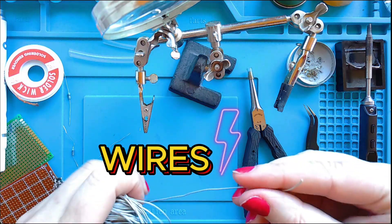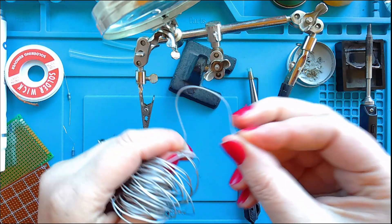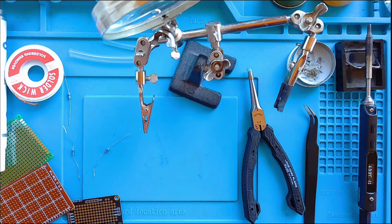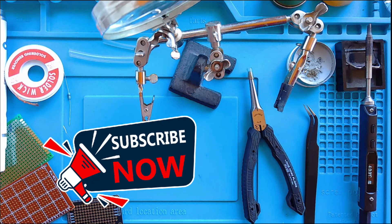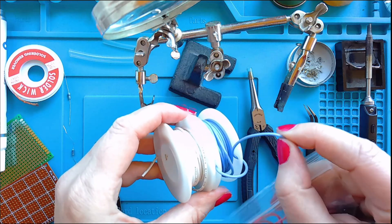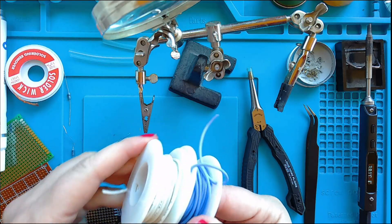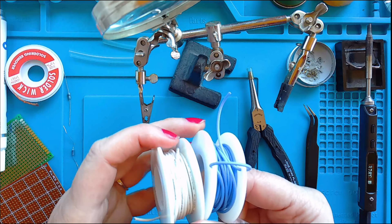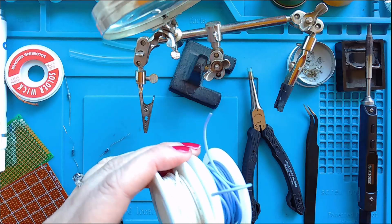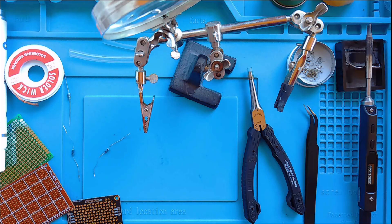There are so many different types of wires. For wearables, I always prefer silicone — the bend and movement on a silicone wire is really fantastic for the circuits we'll be making. You can get them in different thicknesses and styles. I normally use lovely silicone wire; that one's quite a lot larger, I think this one's a 22. It usually says on the wire. I usually get a variety of colors — reds and blacks for power and ground, and then other colors for different data lines, for example.